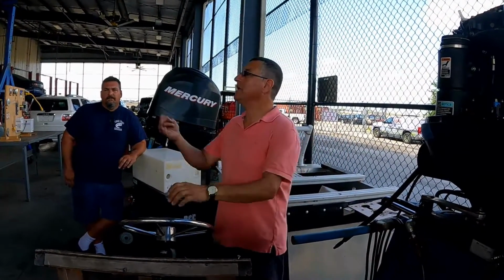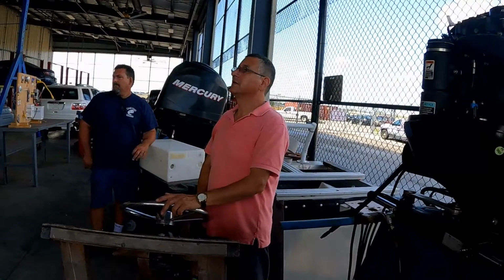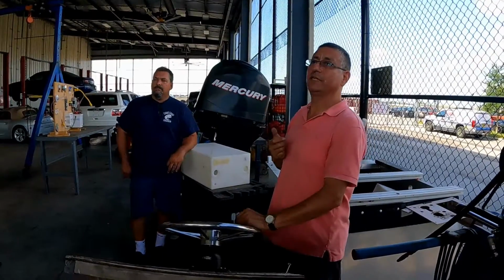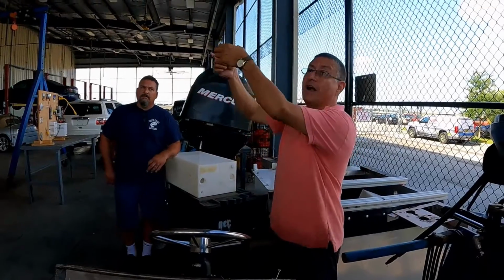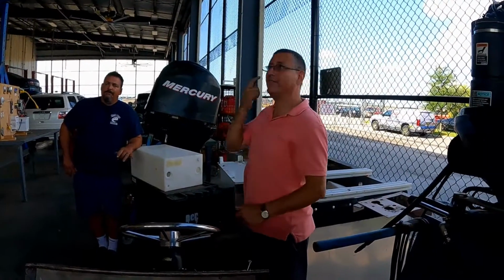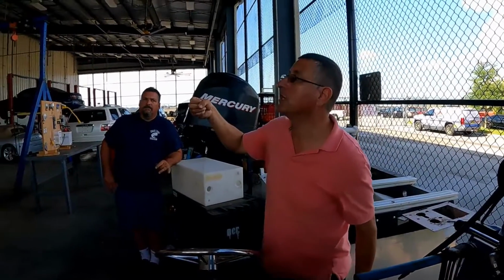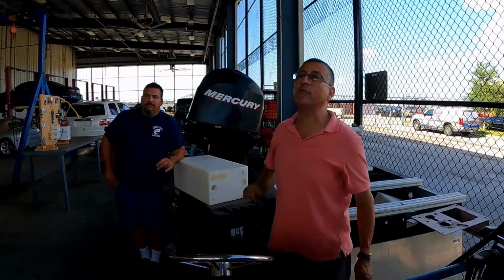What do you think? Give me an advantage of the external reservoir. You can see the fluid level, because they have windows, and the color of the fluid. And you can have a pressure gauge in the reservoir. You can pressurize the system with a little air and verify it. It's nice because you open the hatch and you see, okay, 25 psi and the level is on the limit. Okay, I have fluid, no problem.